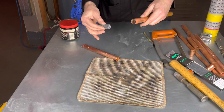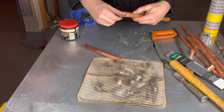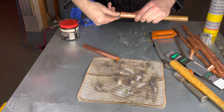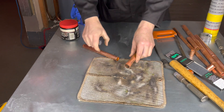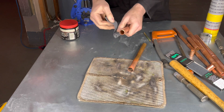We are now going to prepare the pipe to solder it, so we need to clean up the inside of the pipe and also the outside of the pipe that's going to go into the fitting.